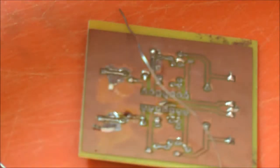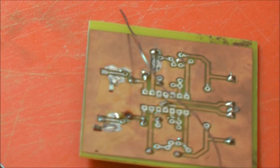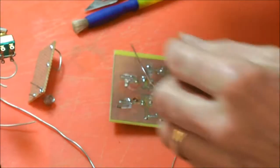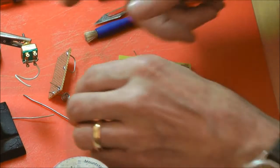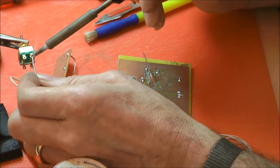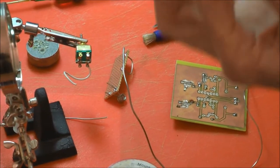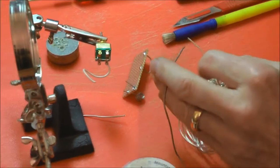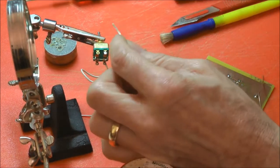If you're doing switches and leads and things, I don't know how many people, like myself, have struggled where you're trying to hold something that's still and you're trying to put a wire onto it. And again, I would always tin the components going onto it, so I'd tin that as well. Make sure that that's tinned.